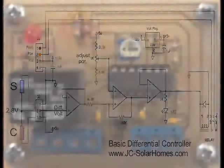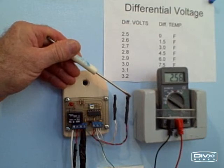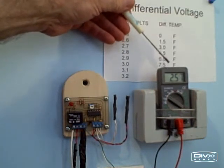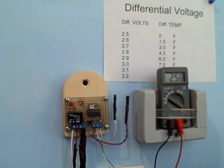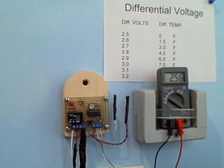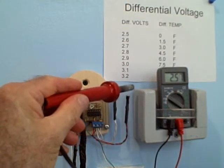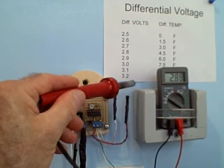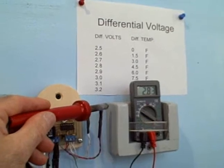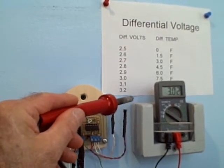Let's take a close look at the operation of a basic differential controller in action. We'll be raising the temperature in the collector — this is the collector thermistor — so I'm going to raise the temperature here and we'll see what happens to the differential input voltage. The first thing I'm going to do is make an adjustment on this pot so that it's totally counterclockwise. This will maximize the heat harvest for the differential controller. In other words, the pump — or in this case the bench grinder — will come on at the lowest possible temperature difference. When I add heat to this point, you can see the temperature starting to go up. The differential input voltage is rising; now it's up to 3 volts, up from close to 2.5 before.